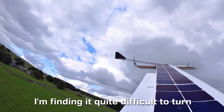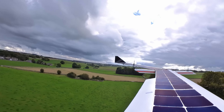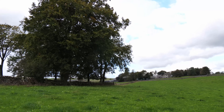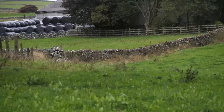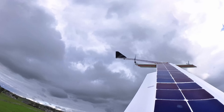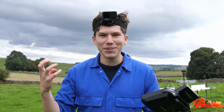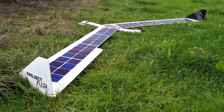Unfortunately, I still wasn't that high up and was finding it quite difficult to turn downwind. Then I made a big piloting mistake — I left it too late to tell the plane to turn, and as it went behind the trees I lost sight of it completely. Relying on the onboard computer to keep the plane level, I cranked it around, but then had no time to roll out as it reappeared. The plane had been locked into a turn, and with its even worse performance than on previous test flights, had no chance of getting out of that rapidly approaching spiral of doom. I got into a flat spin. We made it too heavy — the plane's just got such bad performance now, no power whatsoever. We need like two of those motors on it.